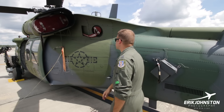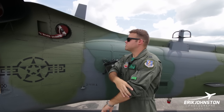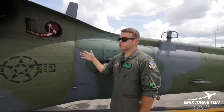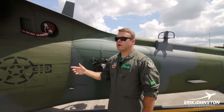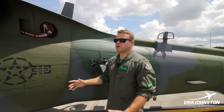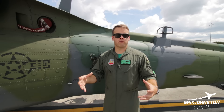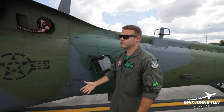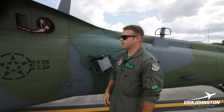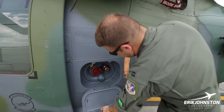There's another tie-down here. This is the exhaust for the APU — the auxiliary power unit — which runs off the fuel system just like the main engines. We start the APU, and it spins a generator that allows us to run avionics without spinning the main rotors. That generator also powers the backup hydraulic pump, so we can check out the flight controls. The 60 has fully redundant hydraulic systems — number one, number two, and a backup pump that runs off an electric motor instead of the transmission. For the Pavehawk specifically, since the hoist is hydraulically driven, the back-enders can check out the hoist before the aircraft is running to make sure it's safe before sending any PJs down it.